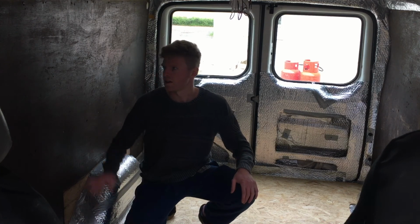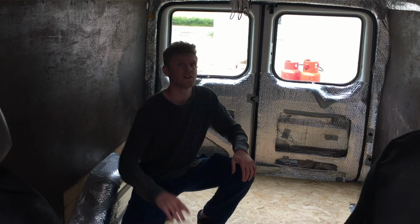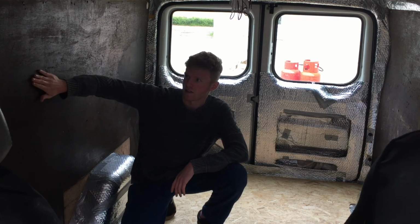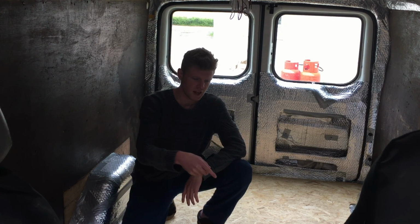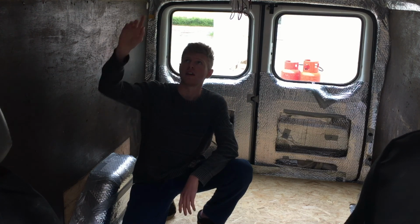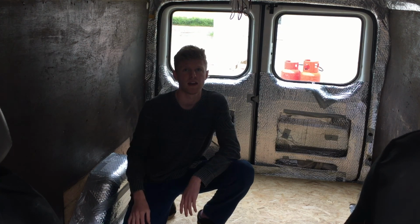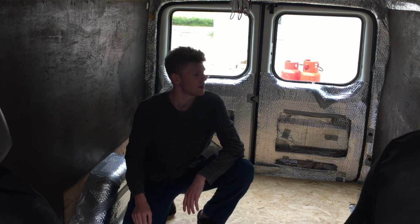Here we are. We've got the ply panels back on the walls, we've got the OSB on the floor. All we need to do now to finish the subsurfaces is, we're obviously going to clad over this, and then I said about putting the laminate on the floor. So all we need to do to finish that layer off is insulate the roof, and then put another possibly plyboard over the top of that, or like a skeleton, so that we can fix our cladding the whole way up the walls and then around the roof.